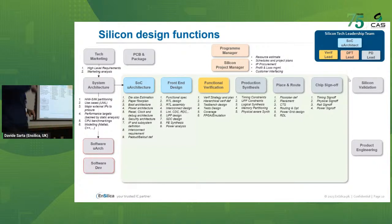So once that is decided, power architecture. That has to be kept under control again. This is two things actually. It's a power estimation that will keep the estimation of your power always under control. You have to make sure that you hit the technical requirements and the system architecture requirements, so you cannot exceed in power. So continuously update your power estimation spreadsheet. But you also have to define your power architecture, which means which blocks will be active, which blocks you shut down or decrease in voltage and so on. So if you have concerns about the power, you have to decide at this point.